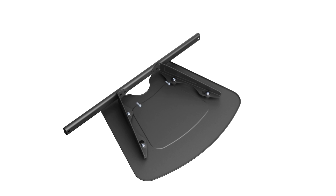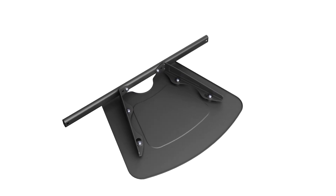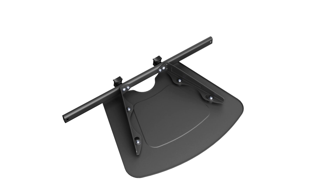Place the support bar against the media shelf and insert two M6 x 14mm screws and tighten with a Phillips screwdriver. Hold the knobs up against the outermost hole in the support bar and insert the M6 x 25mm button head screws and tighten the knobs.